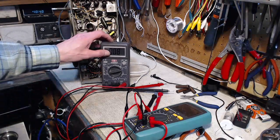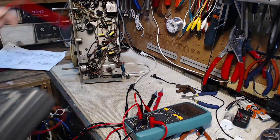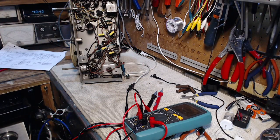And so that's very strong evidence that the capacitor is going to leak some current. We put it under pressure, maybe 100 volts DC or something like that. It's going to leak some current through it. So there's a certain amount of effective resistance going through these now. They're no longer 50 megohms, they're something much lower. And I suppose in certain circumstances, the internal voltage of these capacitors can affect high impedance circuits, like maybe a grid circuit. Not so sure that's really the case.